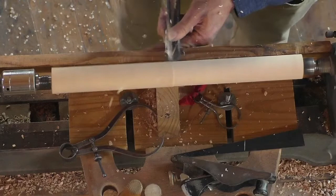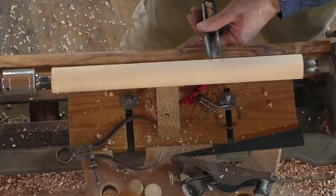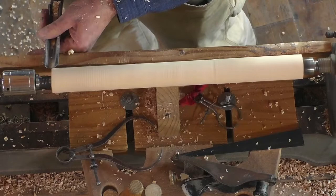Make sure it's locked there. I'm going to go ahead and turn this whole thing down to the major diameter of my reamer blade. Each cut is starting bevel rubbing — nothing's happening. I lift up slightly, right there it starts to cut, and now I drag that along to get my cut.